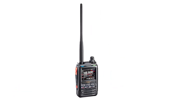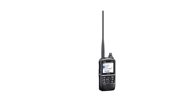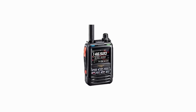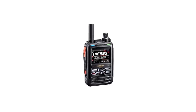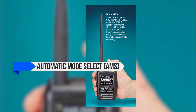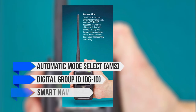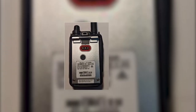The bigger question in choosing between these radios is whether you want Fusion or D-STAR. Yaesu employs C4FM communication with APRS (Automatic Packet Reporting System), while ICOM uses D-STAR. Both transmit and receive data like GPS coordinates, texts, and images — however, Yaesu's APRS implementation generally works better than ICOM's D-STAR. Yaesu's C4FM also provides features like Automatic Mode Select (AMS), Digital Group ID (DGID), and Smart Navigation. With Smart Navigation, users can track their location en route or save it to a microSD card — which can also store pictures to send or receive. The FT5DR will also accept software updates through its microSD card.